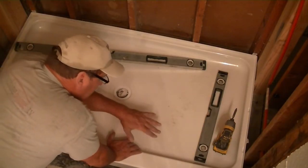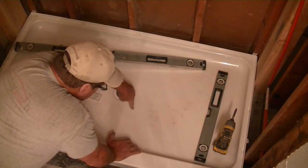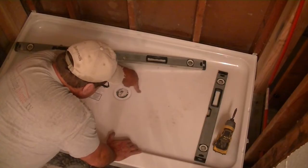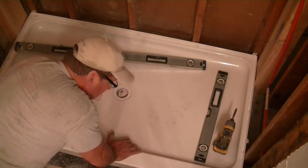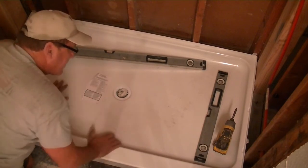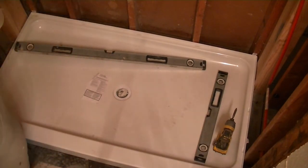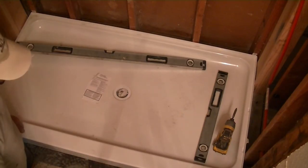So if you've got it up and you've propped up one side and you've got one pin that's underneath a shim and the other isn't really under a shim, but you vibrate that mortar mix, it'll go down and underneath that to support it better. We don't need to do that on this one, but that's another thing that you could do. And once this dries, we'll be able to put the walls in. But that's basically how you do a mortar bed on a shower pan.